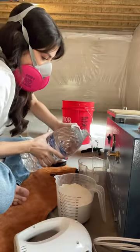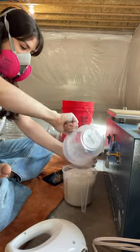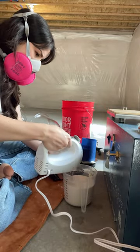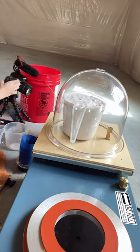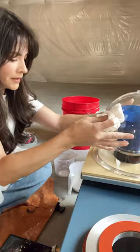This investment is a carcinogen, so you have to wear a respirator when working with it. Once you add it to the water, you only have eight minutes to work with it before it starts to set, so this part gets a little nerve-wracking. Now it's time to vacuum out all the bubbles from the investment, and as you can tell, I underestimated the size of my mixing bowl.